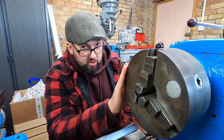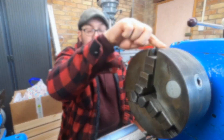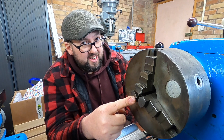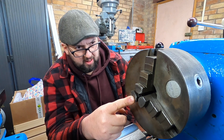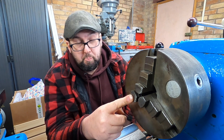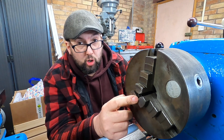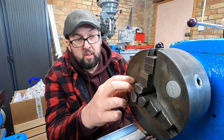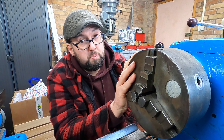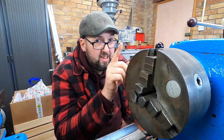The plan is to see whether this chuck is actually attached to a back plate — which it looks like it is because there's a join here. If it does, we might be getting another chuck, because there's no way we can afford the jaws — especially over £300 plus VAT for a set of jaws. Regrinding them is a possibility, but I don't think we're going to do it. From the research I've done, for regrinding jaws you have to have the jaws under tension, and it just seems a whole lot of work when there are cheaper precision chucks out there that we could attach to this back plate.